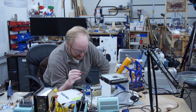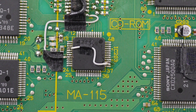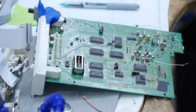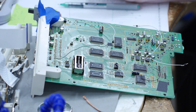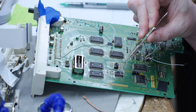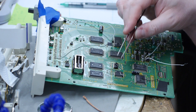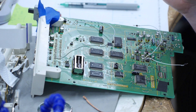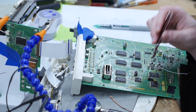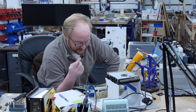I've been doing some mapping of the schematic and I think I know what this mystery chip does. It's probably some sort of bus location decoder chip. I've noticed that someone has mapped out what registers you send data to off the expansion port. So I think what this chip does is it says, oh, you sent such-and-such a register, then I'll let you talk to this chip, or I'll let you talk to the thing on the CD-ROM's LCD. I'm going to continue mapping out this chip - I've got it about halfway - and that will give me more points from which I can test things.